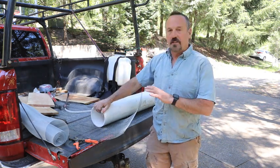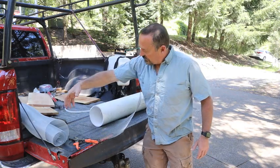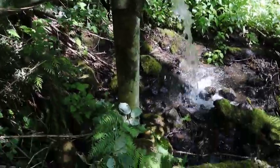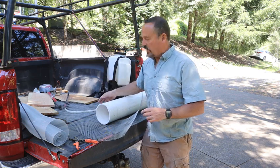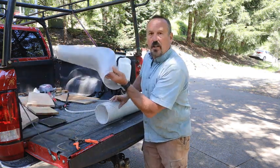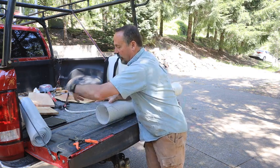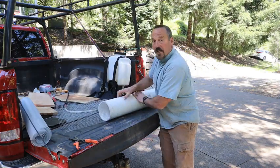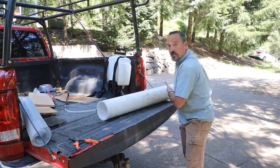I'm going to show you the basics on it and what I do to screen the water out. I'm going to set this up so the water comes in horizontally in a pipe and then drops down to a vertical pipe. I have a very silty creek with a lot of sediment, branches, and stuff coming down, so we have to screen the water out. I'm going to put a screen with half-inch holes around it and then a regular window screen over this, extending it beyond the pipe to give more area for water to get through. I'm also going to cut some slats in the pipe to create open space, put the screen over it, and water can seep into the pipe and run to where my pump is.